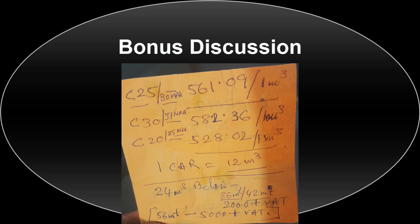When we did the calculation, it was going to cost us about 18,000 Ghana cedis. That was based on a minimum of three trucks for just the two-bedroom side — each truck is 12 cubic meters and we needed at least three of them. The calculation was done using an online concrete quantity calculator. You just need to input the thickness (in our case 6 inches), the breadth, and the length of the slab. We ultimately had to abandon this option because it was way too expensive due to the size of our beams — the width and depth were too large.